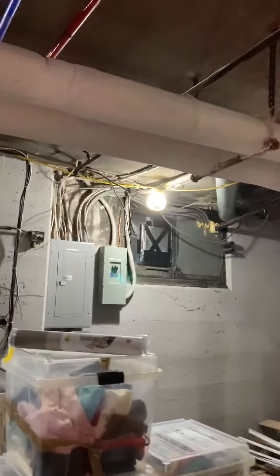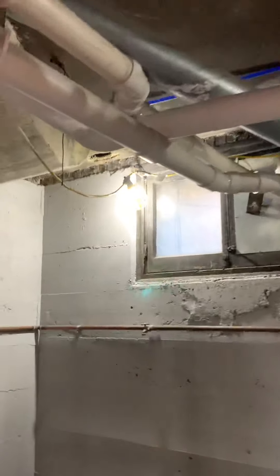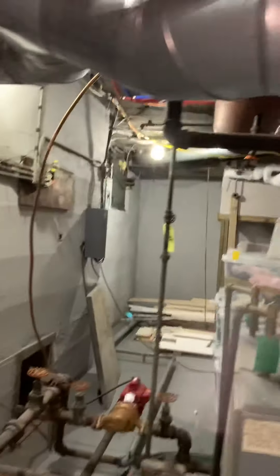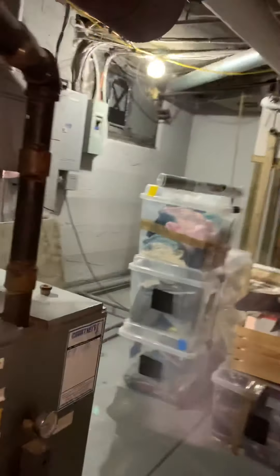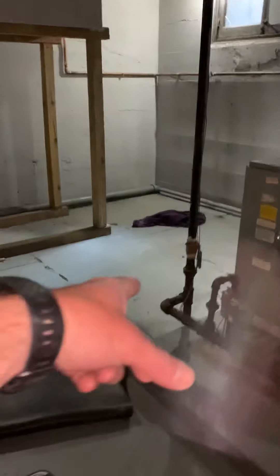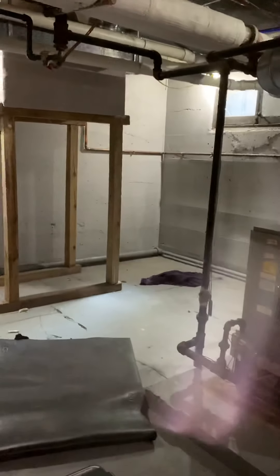On this side we'll do PVC vented. That water heater over there — you can go out that window there, set it over here, go out that window. They do have window well cages but somebody had cut it previously, so we could just go straight up through there. PVC venting — same thing on that side, you'd just have to cut the braces on the outside to get the panels up. There is a walkout in that room where the other water heater is.